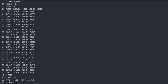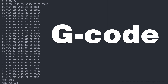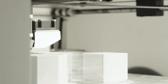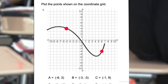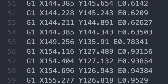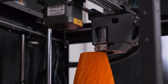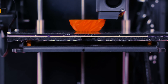The simplicity of this process may surprise you. Behind the scenes, the software will write lines of G-code — the instructions — for each layer. For every layer, the instructions tell the extruder to move to a new location on the X and Y axes. This is similar to 5th grade math when you had to plot points on a coordinate plane. Each point is listed in a strategic order, most often by the most efficient order. Similar to putting frosting on a cake, the extruder continues to move to every sequential point as material is pushed out of the nozzle, until the shape of the individual layer is complete.